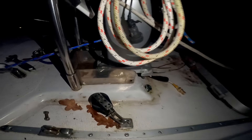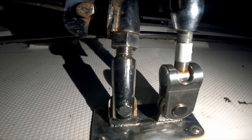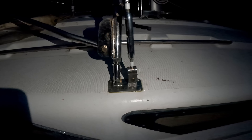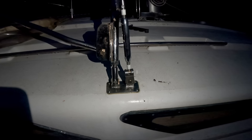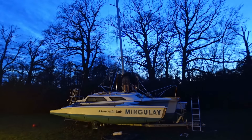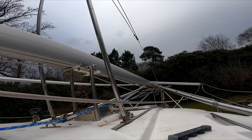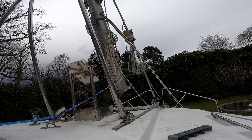It's got a little darker but we have a problem - we've got about an inch underneath the mast base and you can see the mast is slightly swept back. I think this long pole here is a bit too long, but the thing is we had the threads at the bottom remade and I've only got about three threads left. Hopefully that's enough - if not what I can do is go to a machine shop and get them to cut off a bit more and weld it a bit lower. Now as you may have guessed, this was before I had done the compression post repair to raise the roof back up to the correct height. I decided to do a bunch more testing to see how much I could adjust the mast before doing all the work needed - it was very obvious that to keep the geometry correct I had to sort out the roof to get that extra inch that I needed. But just look at how epic and easy this system is to raise and lower the mast.